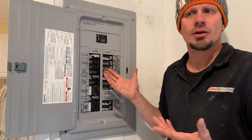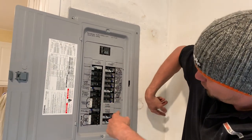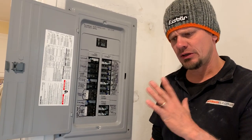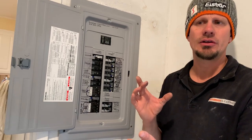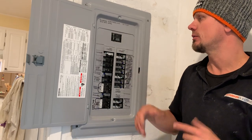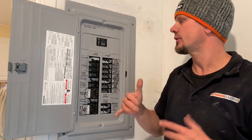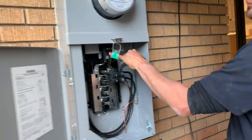I talked to a Fort Collins inspector today and said to him: it doesn't say five feet close, or a nipple, or back to back, or side by side, or a two-foot piece of PVC. But it does say in 230 — I think it's around 70 or 50 — that if it's a service entrance conductor, it has to be protected by a certain conduit: IMC, PVC — doesn't even allow schedule 40, it's schedule 80 in the wall. So our main breaker is out here at 125 amp with 100 amp feeding this one. I just had an extra breaker on the truck from another job, and I felt like I'd like to kill it here and out there. It doesn't hurt, but you're supposed to have it outside. So if you have it outside in the new 2020 code, they are going to make you kill this one and have it out here.